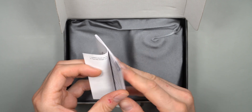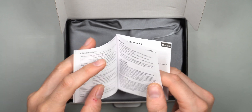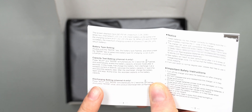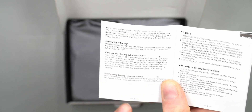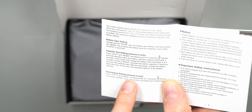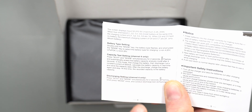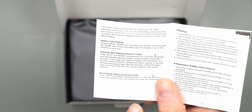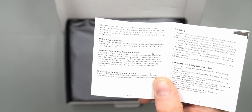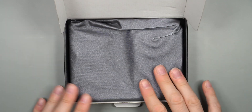The manual is available in multiple languages — Dutch, Spanish, French, and Chinese. It confirms that only channel 4 is for testing battery capacity and discharging. Discharging is limited to 500 milliamps, so you cannot go up to 2-amp discharge. That's one minor drawback of a charger at this price point.